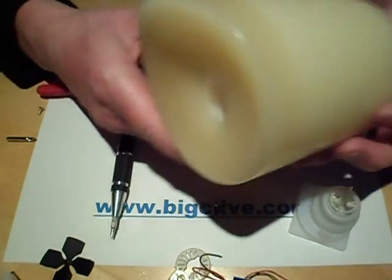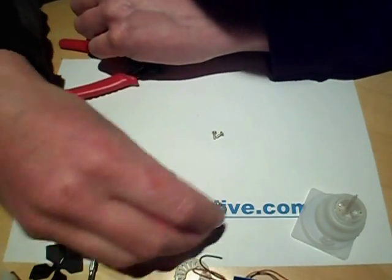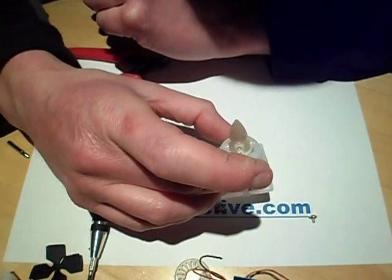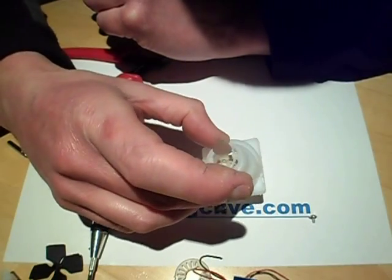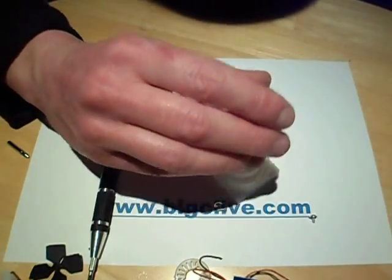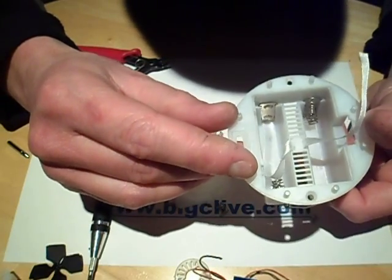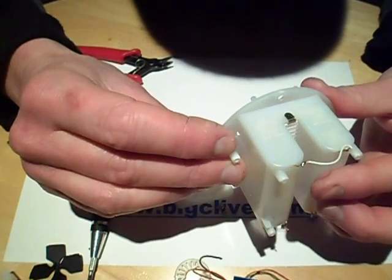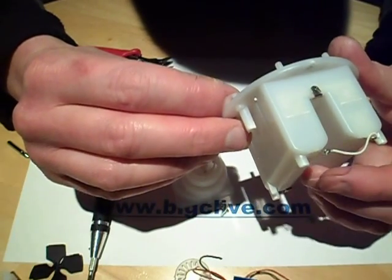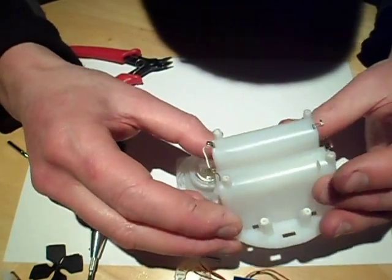What can I say — it's probably a really good idea at the time. They probably thought it was going to be quieter, and that it was going to flicker better, but all the reviews I found online were not very good. That's ultimately why I bought it — just to see how bad it could be. I think I'll hack this because it does have possibilities. If the battery holders are rewired so it's a normal series arrangement, it can make six volts and then you can run a warm white LED. So there's some possibility there.